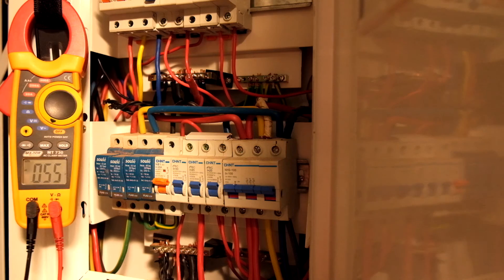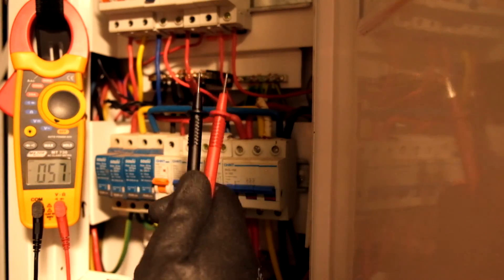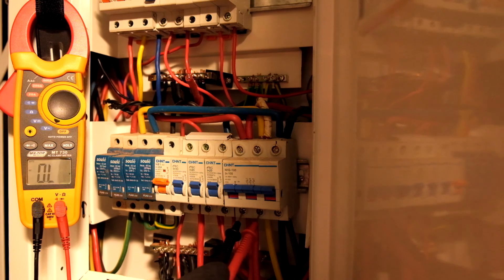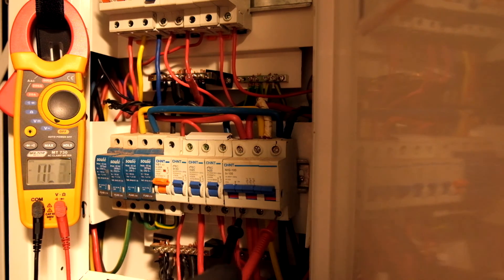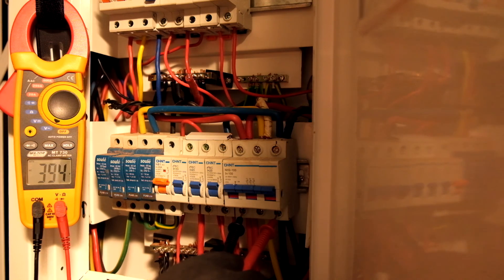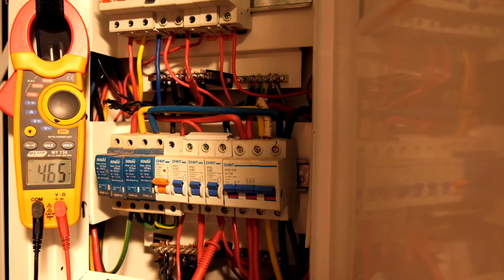Pretty good for referencing purposes. The meter is CAT3 600 volts, so it should be perfectly safe for these three-phase measurements. When doing three-phase measurements, it's generally best to hold it in one hand and then probe the phases. Split them and go phase to phase — one-handed — so your other hand is always away from it. It just reduces the risk of electric shock. Wherever possible, make use of doing measurements like that — it definitely keeps the safety factor much higher.